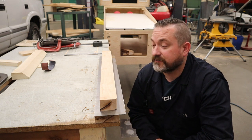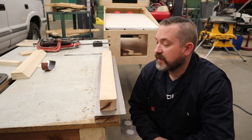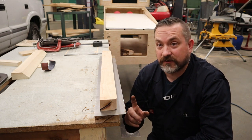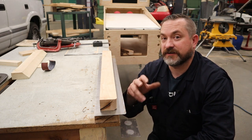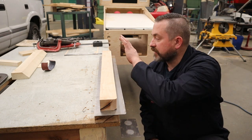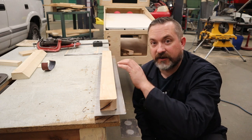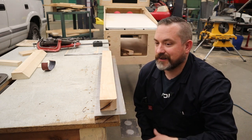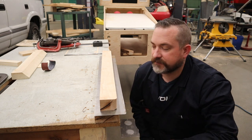I think 1, 2, 3, maybe even 4 clamps is not enough. I would say 6 or 7 clamps. And because we are not putting a solid bolt through a hole through the metal to positively make sure that this metal doesn't move, I think what I'm going to do is a little bit here on this end and a little bit there and a little bit here and a little bit there to try to kind of lock it in place so it doesn't want to move before I just hammer all on one side, get it to shift.